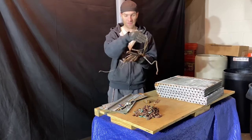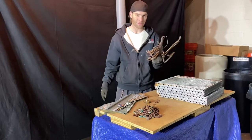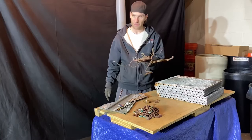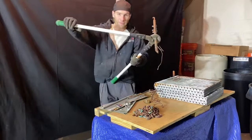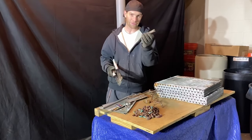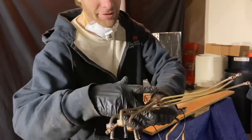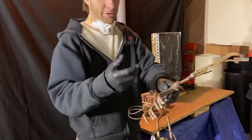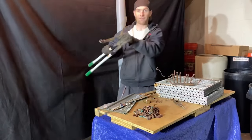Or if you want to try to get every little bit extra that you can, you can break this down further. One of the easiest ways I've found to cut copper is the same way you would cut copper wire — using a whole pair of loppers. Just find where you want to cut. Now you've got quick, easy number one copper without using your Sawzall. Cut these ends off and you have number one. Then that is number two copper. Now you're starting a little pile of number one.